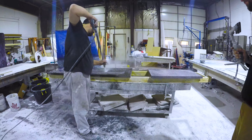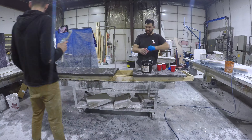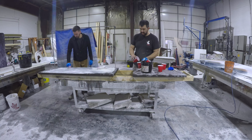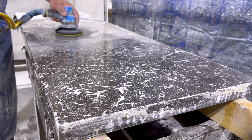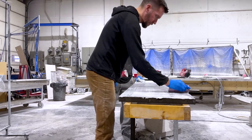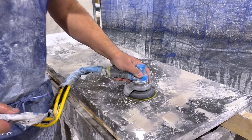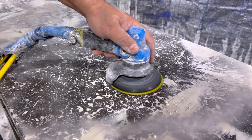Polishing was definitely more work than I thought, and so was the grouting. You mix up your grout — we got ours from Unicon in bone white — rub it into the cracks, but the problem is it has water in it and as it dries it shrinks. So you've got to knock it down with the polisher, then add another layer, knock it down again, add another layer. Simon told me this is a lot of work. It's great for a DIYer who has time to put into this, but be aware you've got a few steps and it takes some time — otherwise you'll end up with uneven divots in your finished countertop.